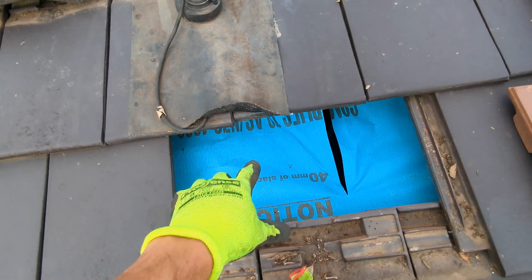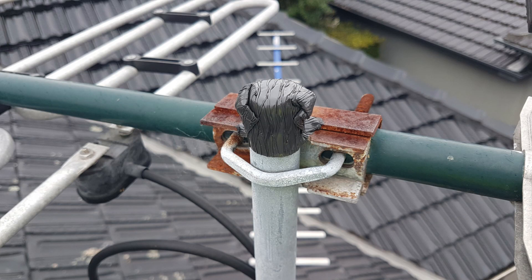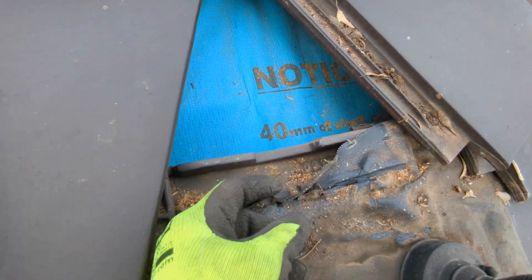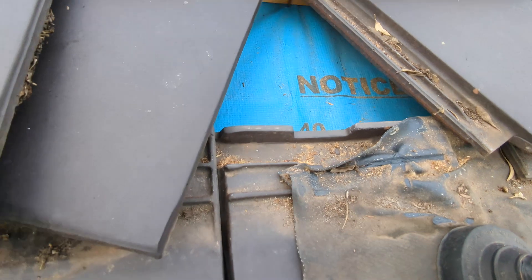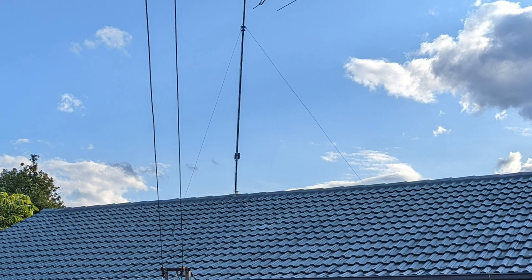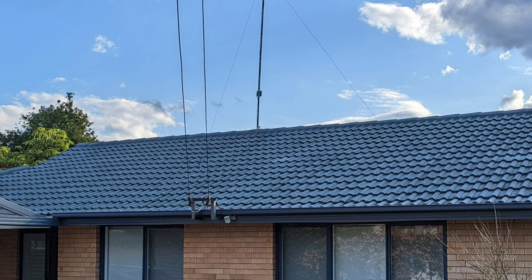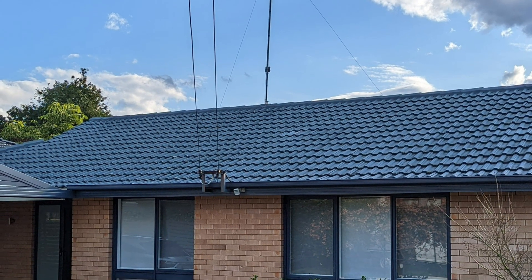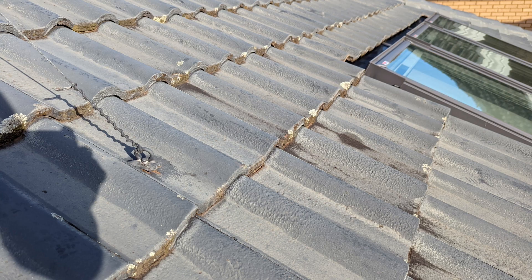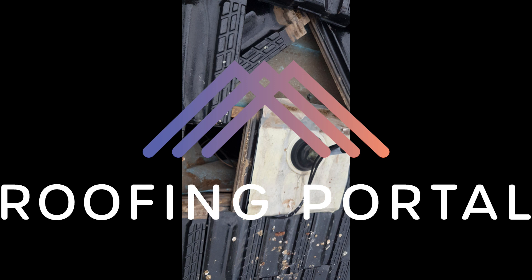So even this style of TV aerial is not maintenance free. You need to, on a regular basis, make sure that the cap is intact and that the flashing around the base of the aerial is still okay, and then you won't have any leaks with this style of TV aerial. So which TV aerial is better? It doesn't really matter — they both have their pros and cons. The main thing is you need to be aware of where the water can come in and have a regular maintenance schedule where you get someone to go up, check the seals, check the cap, and make sure that everything's okay. Otherwise, you will get a leak through your TV aerial.